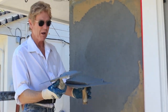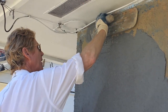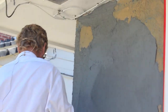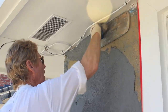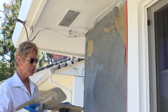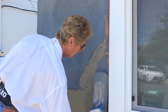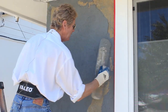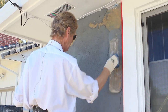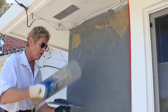I'm going to take some mud off the hawk. What I'll do is push it right here, put it up, and pull my fingers back — I'll show you why in a minute. I don't want mud all over that wire which is in my way, and when I float I don't want a big mark there. I've got too much mud on this hawk so I'm going to use it up by application, generally just covering this section. Madeline, put the tape right next to the window — there's no need to cover a whole window when we're just doing that little bit.